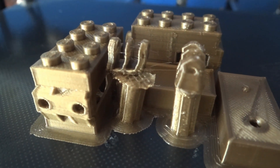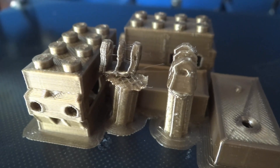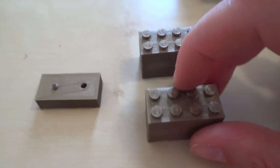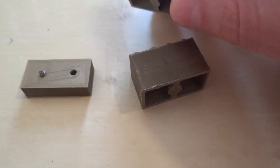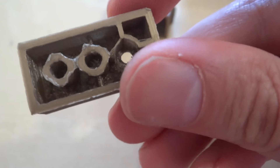As you can see, the 3D printer did something really funky — not really sure what happened there. Here you can see the first versions of the parts. They worked out decently well, but have issues. Because of the design and lack of supports, the valves printed rather messily. The mounting brick for the solenoid is a bit messy too and needs a better hole for the screw.